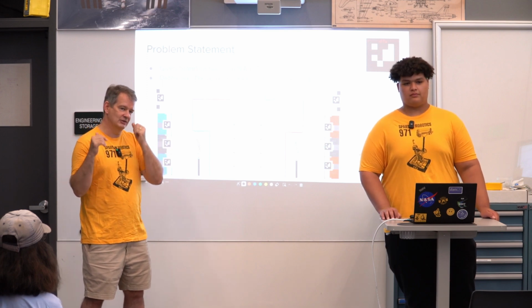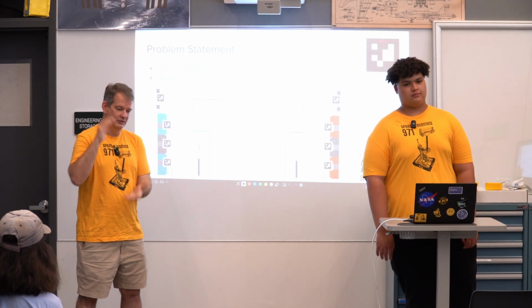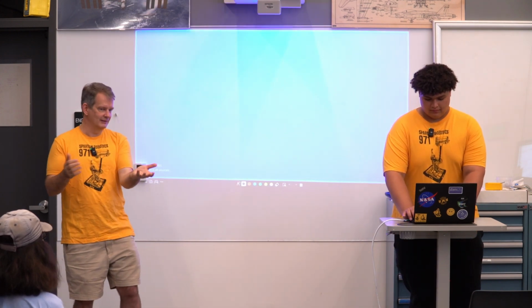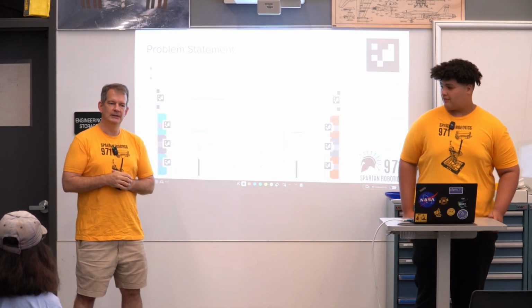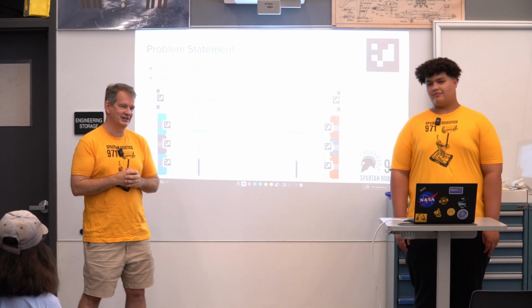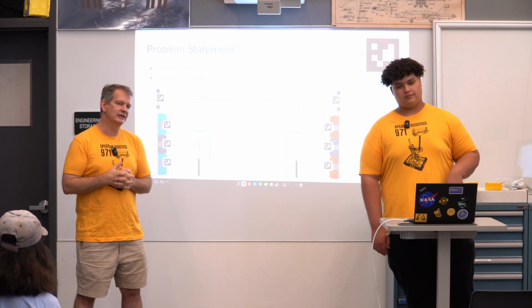And so it's trying to make sure you have enough light coming into the camera so your exposure is long enough. Your sensitivity, it's not actually dynamic range here anymore, but your sensitivity is high enough to be able to pull in what you need there. So to answer your question, we're shifting towards a global shutter, but I think it's still a debate we're having what the right approach there is. I'd love to talk to people about that more. It's an open question. I don't think we'll resolve it any particular year, but we're moving towards using a global shutter right now.